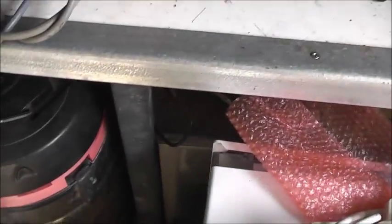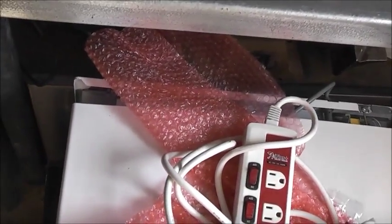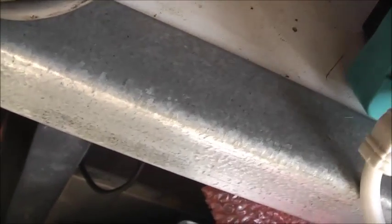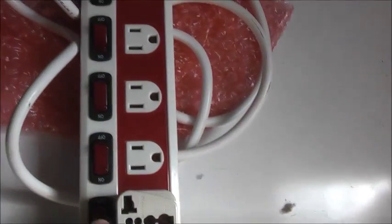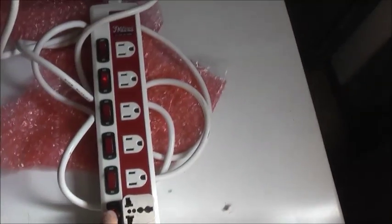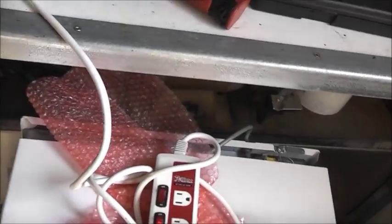I know, actually, what I'm going to do, I'll do a test. Non-polarised. This is polarised, but this isn't. I'll use that and I'll test this vacuum cleaner, do a current measurement. That'd be a good idea. This is all earth through the mains, but everything is earth here through the mains, except this one. I'm going to do it manually. This is just for a quick test. This is a double insulated appliance anyway, so it shouldn't matter. Should be okay. If I'm going to run something that actually needs to be earthed, then obviously I won't use that adapter like that. I'll put a little plug in here where the clips will plug in with only the earth connected, and I'll just plug it into the earth, should I need to test something that's dual voltage and it needs to be earthed.